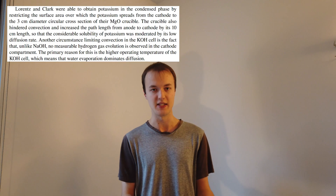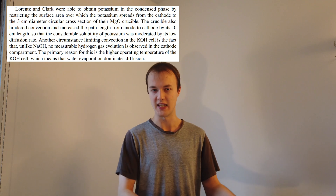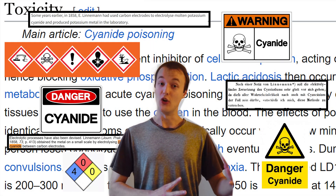I've got two ideas for making it work. First of all, I've found that molten potassium hydroxide can be electrolyzed to give potassium metal under some conditions — a much more complicated cell where we exclude atmospheric oxygen and also limit the rate of dissolved potassium in the melt from diffusing through the liquid mass. My second idea I might not actually talk about for the moment. Both ideas require a fair bit of thinking, so it's going to be a long wait, but in the meantime there are a bunch more metals we can try to make by molten salt electrolysis. So until then, I'll see you later.